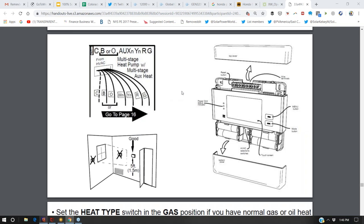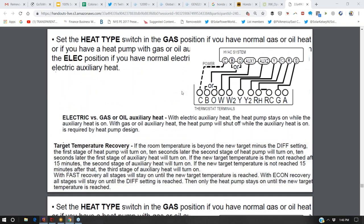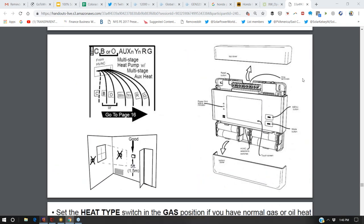Thermostats have similar relays built into them. In the interest of time, we're not going to spend too much time talking about these thermostats, but what I think is kind of interesting is there are thermostats that are battery only, and then thermostats that are powered by the wall and have battery backup. I've seen people take a battery only thermostat and replace it with a Nest. And then all of a sudden, their batteries are running out every 2 weeks, because the Nest is supposed to be powered by the wall, not running off batteries only. The batteries in the Nest are there for battery backup, so the settings don't get lost when you run out of power.